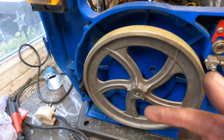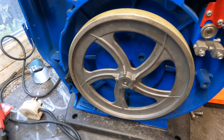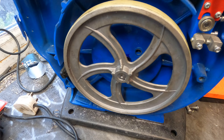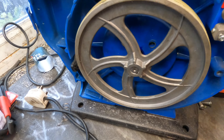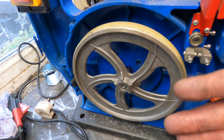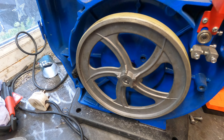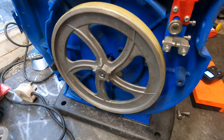As I said in a previous episode, I inherited this with the machine and really need to look into making something better or buying one. I don't think the wobble will matter much — hopefully. The next steps are: drill it, thread it, cut the key, and I might be able to slightly shim it over to make it a bit better. What I'm pleased with is that the body there is no longer moving around, and with it tight on the bearing block I can secure it nicely.